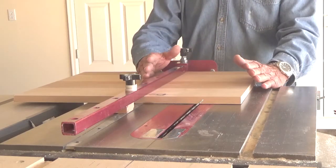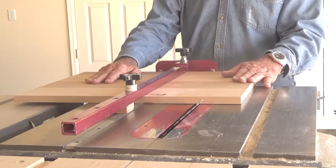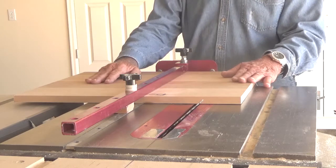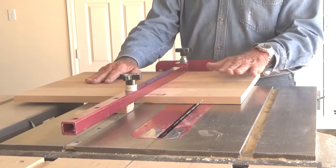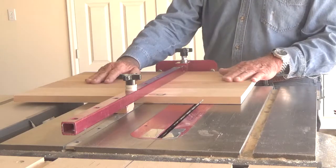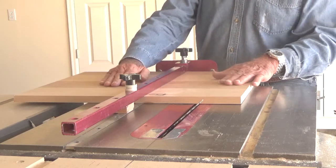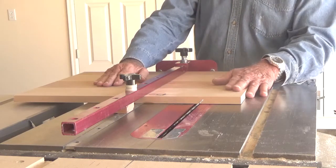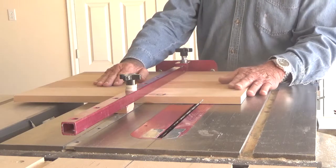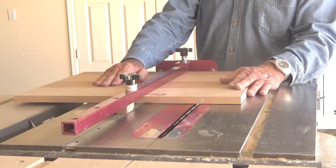Now I'm going to make a waterfall on a glued up tabletop. This has always been hard to do because to get a good fit, both 45s have to be perfect. There is a slight bow in this top, so to try and cut it using the saw guide and trying to hold it down straight on the table is just too hard to do.